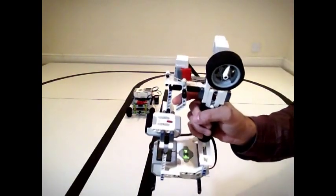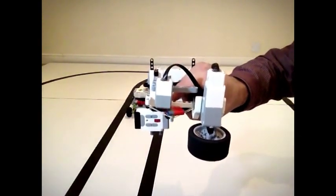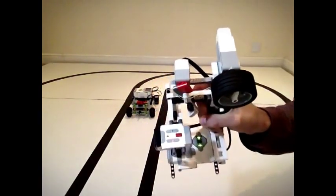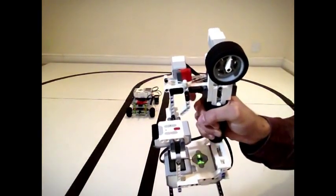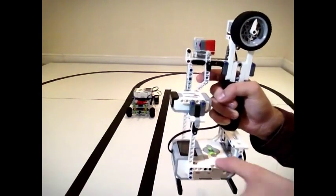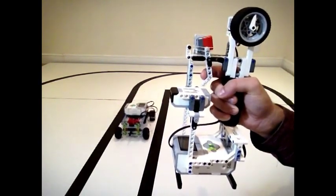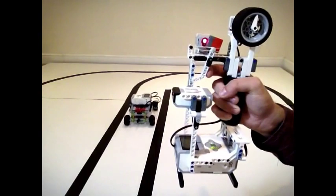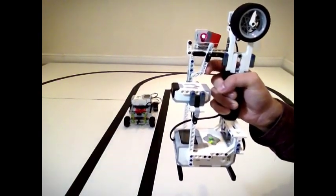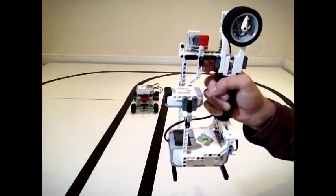Here is the light sensor. The light sensor emits a red light onto the trigger. The sensor can decipher the trigger's position by measuring the amount of red light reflected back to the sensor. This gives the throttle an analog value that allows for varying degrees of acceleration. Rubber bands help keep the trigger at a neutral position. As you can see, the trigger is quite sensitive — the varying degrees of acceleration allow you to go slow or fast depending on how far you pull the trigger.